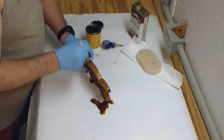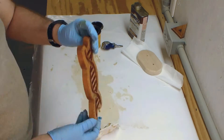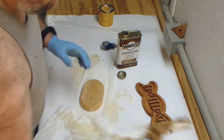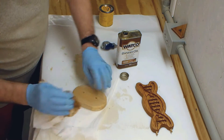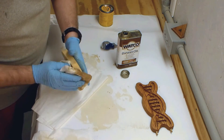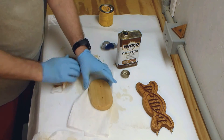Staining is pretty straightforward. The only trick I can give you is after I stained it up, I wiped it down with a rag. The base I was going to do in Danish oil — it gives it a nice finish but it isn't quite dark enough. So what I do is use the rag I've already wiped the darker stain off with and just slightly touch it, which gives it just a little bit of color. It's not a full stain, but between the Danish oil and that it gives it a little pop of color so it's not so blonde against the dark wood.